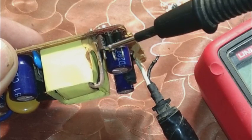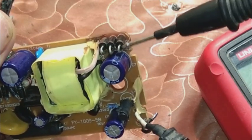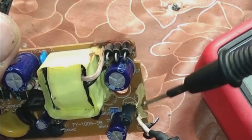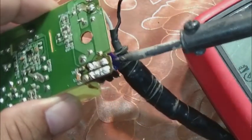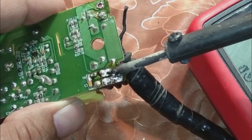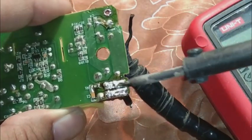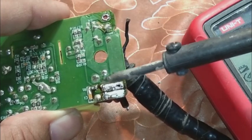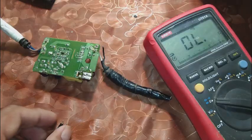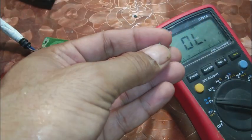So now I am attacking the diodes. I will remove them one by one — there are three diodes here. First this one, second this one, third this one. If any of the diodes is short circuited we will experience a short over here. So let me remove them one by one. I removed the first diode and now I am going to test it.